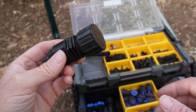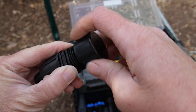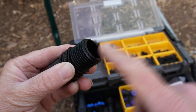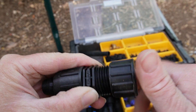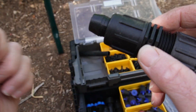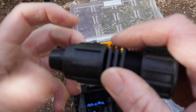The other one I commonly have on hand is the end caps. This just sticks on at the end of your line and has a cap you can unscrew. You can run your system periodically — maybe once a year — and just purge out the line, letting water flow out and push any sediment out. You basically screw this piece on all the way to expose the barb, push the barb into your polytubing, and rotate it as tight as it'll go. I've never had these leak — they're awesome.